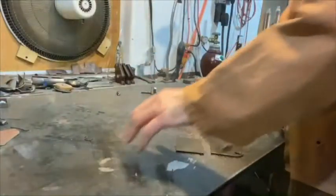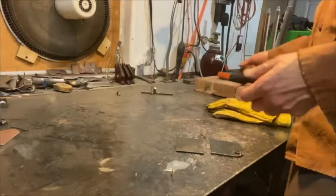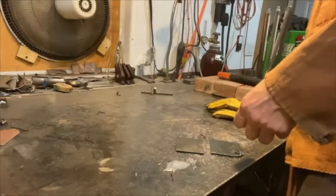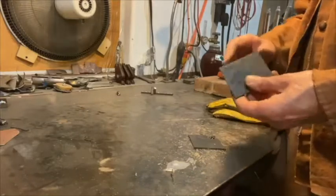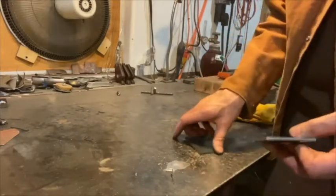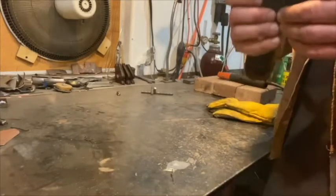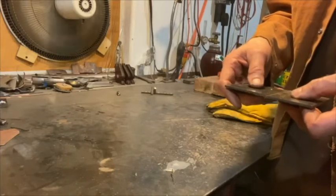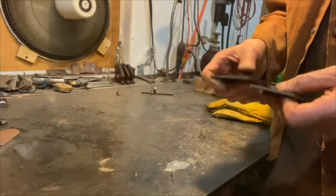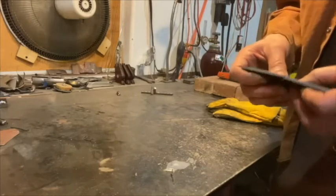You could work on a table like this, or if your piece is big, you can set it on the ground and clamp the ground clamp directly to the piece itself. I could grind a bevel on this — you can see right now it's flat. If it's really thick, I can grind a bevel, but for most of the 1/8-inch stuff you guys have, you're not going to worry about that. A cleaner edge works best — fit-up is important, and grinding off the scale helps.